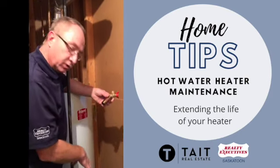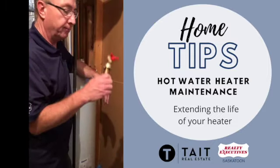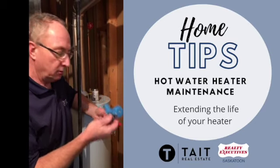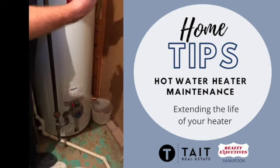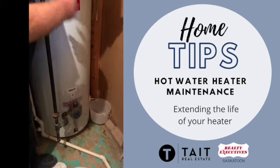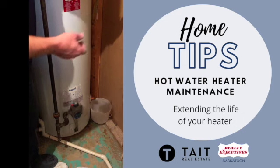Again, put the pilot light on, drain the tank out, pull that out and put a new one in. I've got the old valve taken out and I'm going to put the new valve on. I've put a stem inside there, put some teflon tape on it and some pipe dope, and I flushed it out a few times. There was a lot of sediment in there, but now it's out.